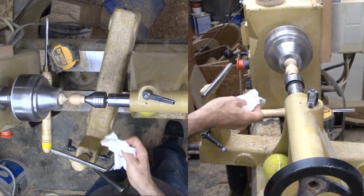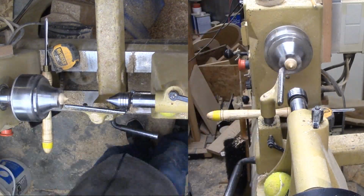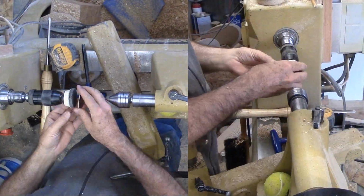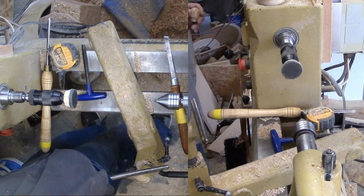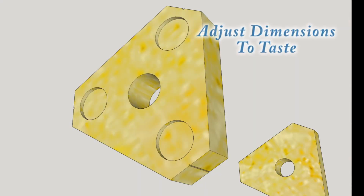After the lacquer dried, I sanded it back again just a little before applying a mix of mineral oil and beeswax. I did need to mount a sanding pad to finish off the nub. I went back over each piece similarly. Final assembly is to glue the tenons through the plywood and into the next piece.